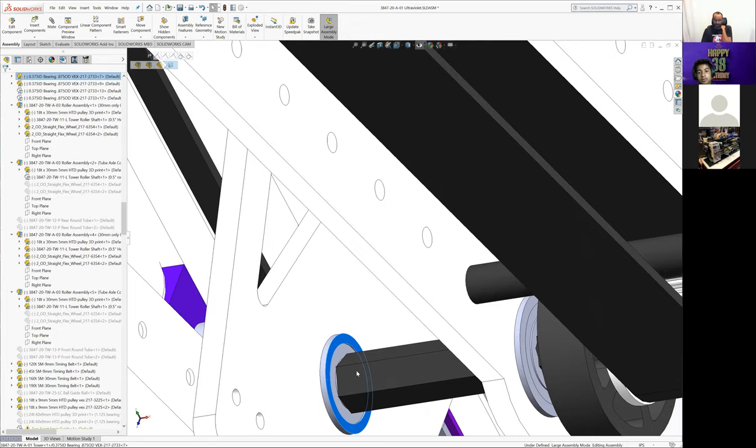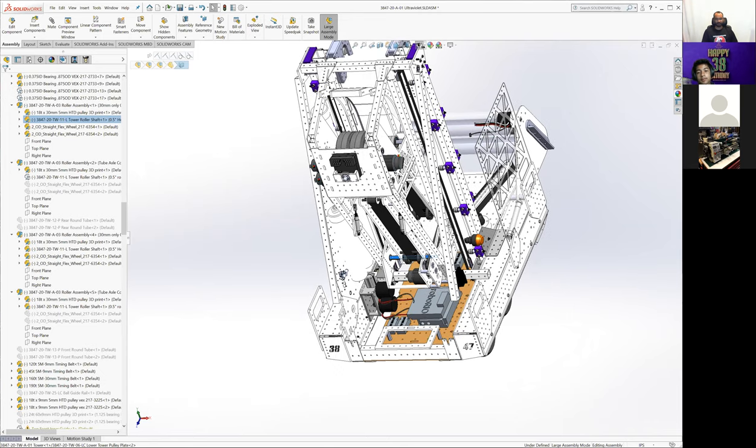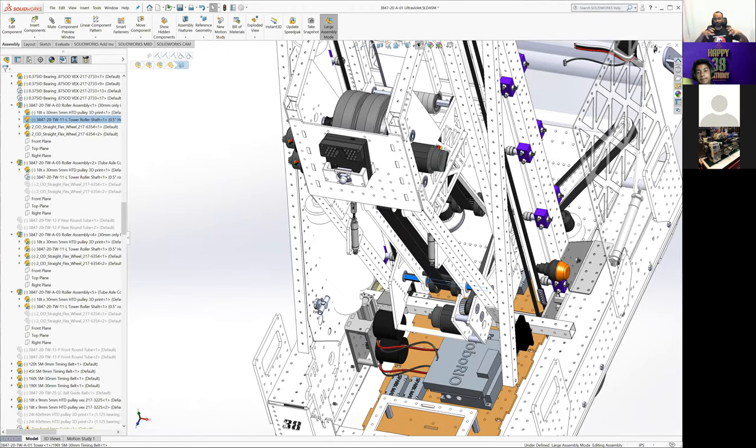Inside the ID of the bearing, which is 3/8, there's a bushing that's just acting as a reducer that goes from that 3/8 ID to a 1/4 inch ID, and then there's just a 1/4 inch bolt going through it. So we're able to clamp the shaft up to the bearing with that 1/4 inch bolt, and everything's spinning on the 3/8 bearing nicely. But we get a little bit lighter since we just have that bronze bushing and a 1/4-20 bolt than the full 3/8 shoulder bolt. Thank you, Felipe, I completely forgot we did that. Those are just some places where we're trying to get some minor weight savings. There were probably other places we could have saved weight had we been designing the robot from the start, but we were going back in and trying to shave weight, and that's one of the places where we knew we could do it.